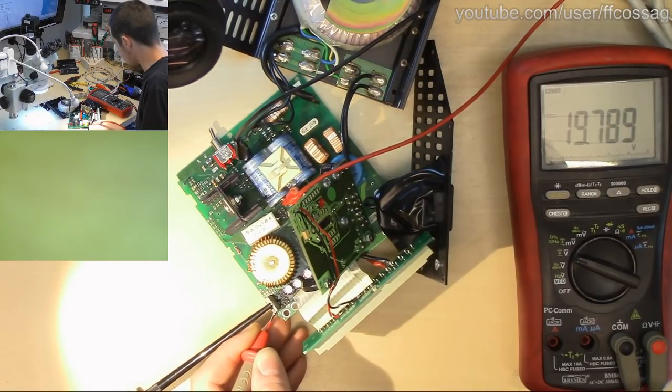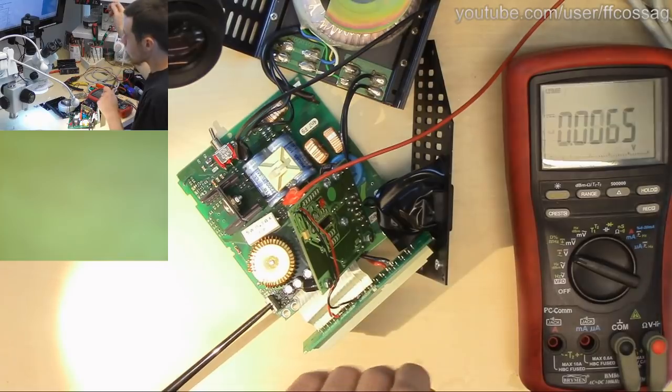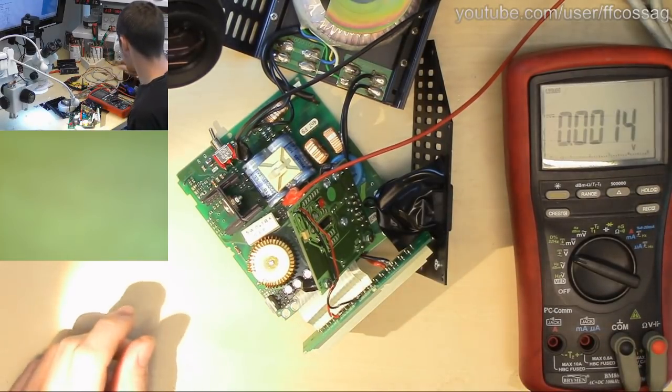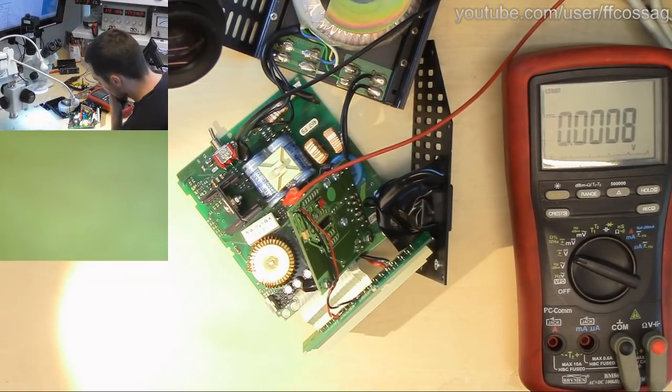Yeah, we're up to almost 24 volts on the input, and that's keeping absolutely stable. And if we just drop it down, there we go, it has about 0.2 volts of drop across it, but it does cap out at 19.78. Could be some kind of constant current thingamajig, but it does regulate, it caps the voltage. I strongly doubt that the device is going to be an issue.